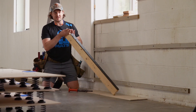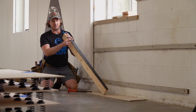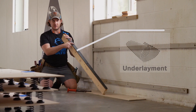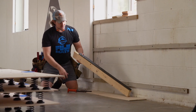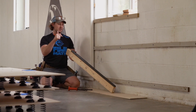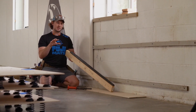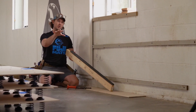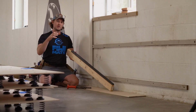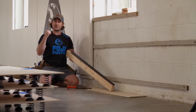We've got a really big spring floor going in today. What we're doing is we just took a two by four and nailed a piece of foam — you can use a weather seal strip or, in this case, underlayment from Fuji. I shimmed this up to the appropriate height and I'm going to nail this to the wall. I can then screw my spring floor system to this board, which prevents the spring floor from moving outward. When you do warm-ups in the morning and run in a circle, you get a little twist in your floor — we want to keep that floor as tight as possible.